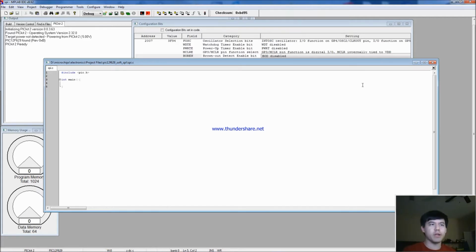I thought I'd do a very quick tutorial, especially since it's relevant to the digital clock that I made using this display that was donated to me by IC Station. And this guy communicates over a serial peripheral interface, or SPI bus. So I'm going to show you guys today how to actually soft-code one, just using software, no extra hardware necessary, using the GPIO on this chip here, which is a PIC 12F629.